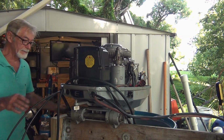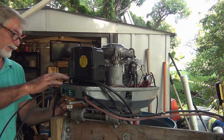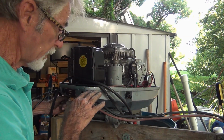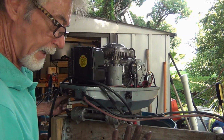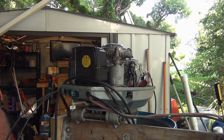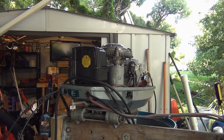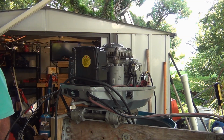So what's happening, besides water going all over the place, is I lift the fast start lever up, it's slowly going back down by itself. So I got to adjust that tensioner on there. And I couldn't even turn the damn thing. So let me adjust this thing real quick. Boy, she fired right up. I think the problem with this is I got it turned all the way too far. Yeah, I'll give that a try.